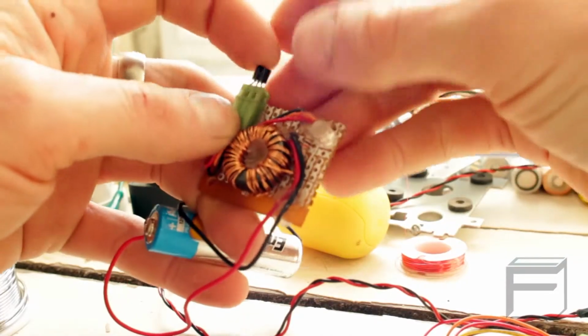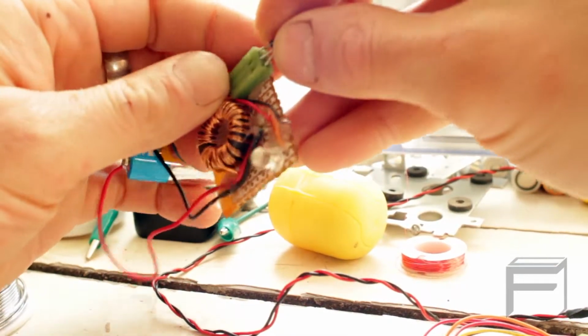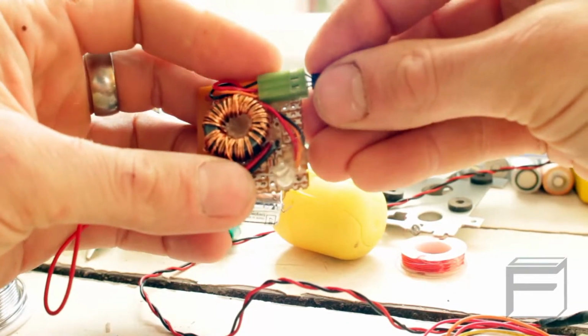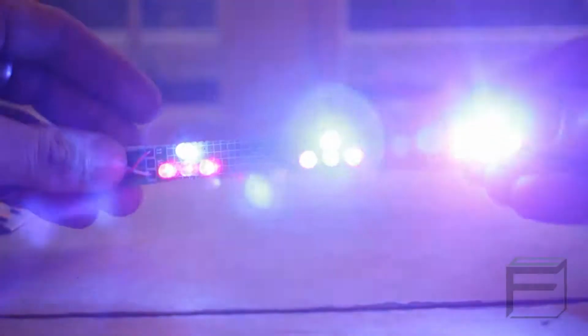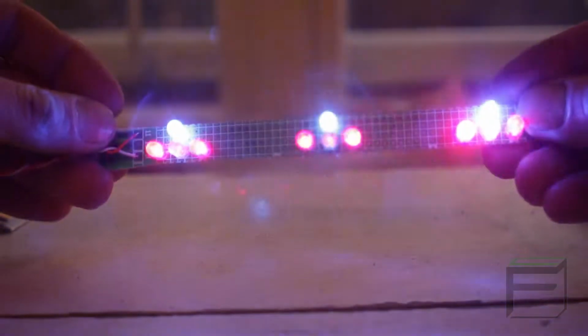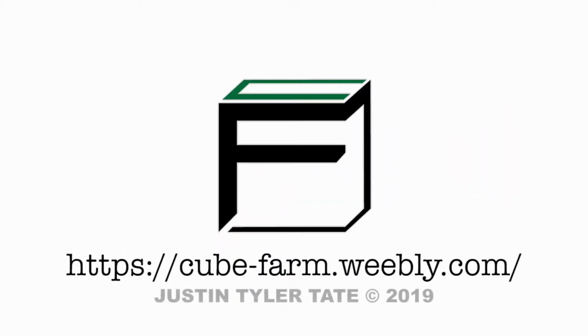As an additional note, you can make one of these circuits with a 3-hole connector attached to it where the transistor should be, so that you can test salvage transistors to see if they can be used in future Joule Thief circuits. Now you can use dead batteries to power LED grow lights that will aid in the growth of plants for your CubeFarm before you eventually recycle these batteries when you have finally stolen every last bit of power from them.